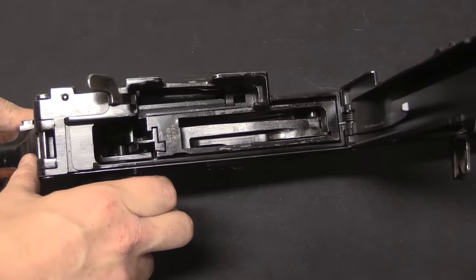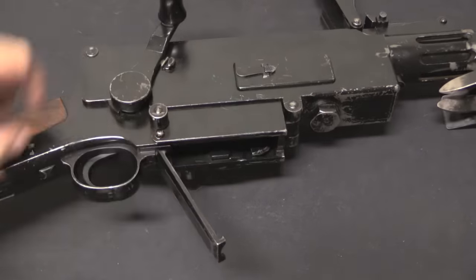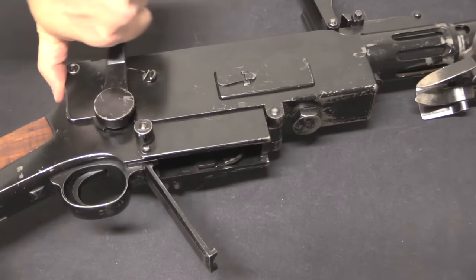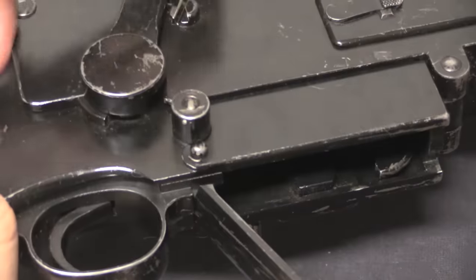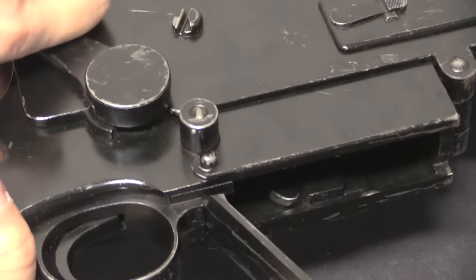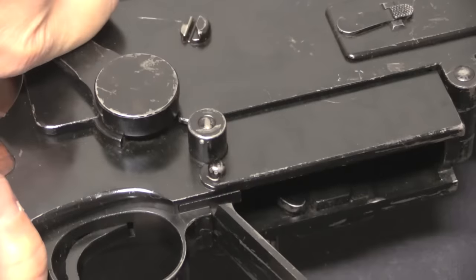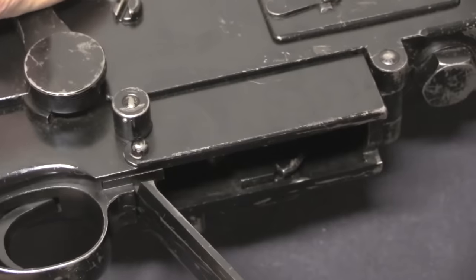If we look here at the bottom, that's the lug for the camming lever. You can see that lever coming back, hooking that square lug, rotating around it, forward and back. So that's what operates the ramming lever.